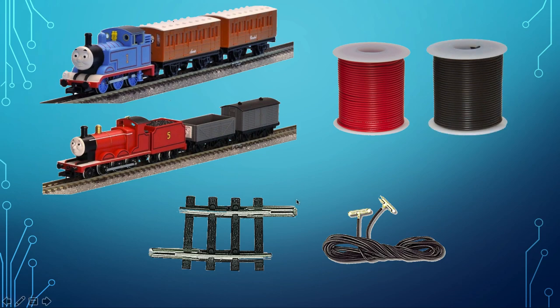If you have an Arduino Uno you could use jumper wires and that'll be good enough. If you make your own Arduino like I do, I like to use 22-gauge wire, and for the 12-volt application — controlling both trains — I use 18-gauge wire. They don't draw a lot of current, maybe 800 milliamps max at full throttle, but I still prefer 18-gauge for the 12-volt side.